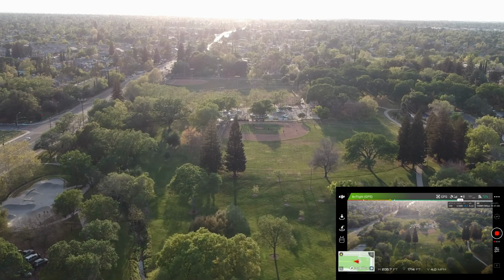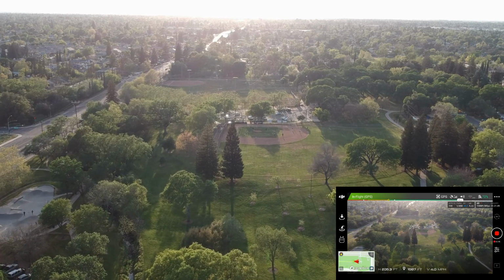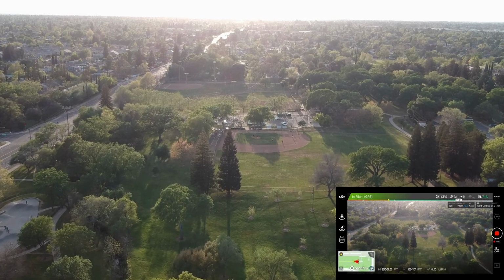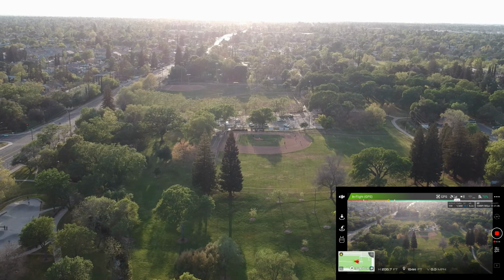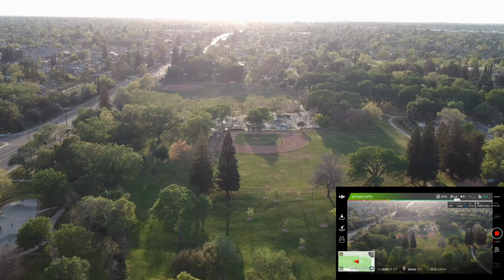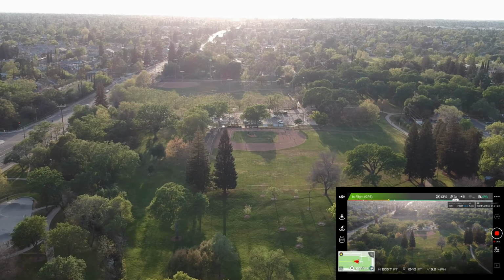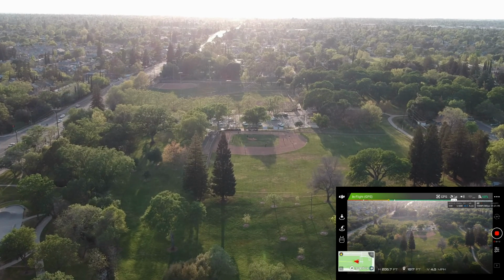Now if I tilt them up, I'm just going to tilt them up about 45 degrees. Not bad, still have maintained. Let's go a little further than that. 60 degrees, yep, that dropped the signal. How about if we point them down towards the ground? They're actually pointing down towards the ground, and we must be getting enough reflection off the grass here. I have it pointing 45 degrees down towards the ground. Still maintaining good. Again, let's see, we're 1,600 feet.